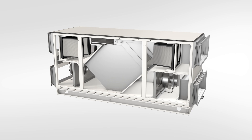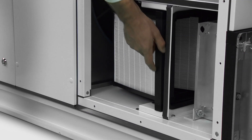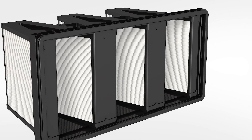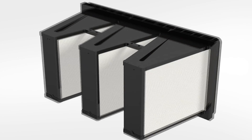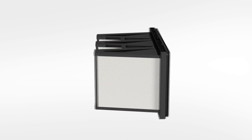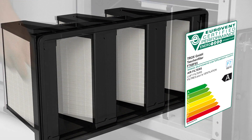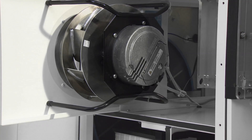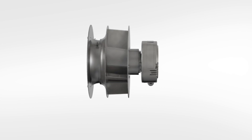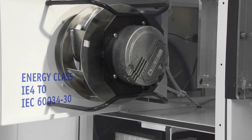What these two construction variants have in common is their uncluttered, pleasant, and clearly laid out interior — and everything is so easy to operate. Take the two Trox filter inserts, for example. They can be completely removed for cleaning, replacement, or changing the operating side, without even needing a tool. The filters have a compact depth, low initial pressure differential, and high dust holding capacity. They are certified by Eurovent and comply with Energy Class A. The plug fans can be removed in the same way. They ensure optimum efficiency and the lowest sound pressure level even under partial loads, and their EC motor complies with the future IE4 efficiency class.